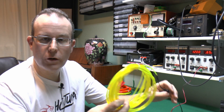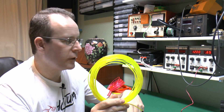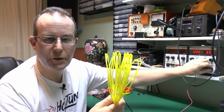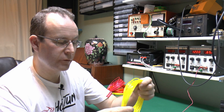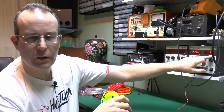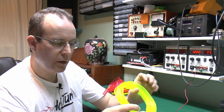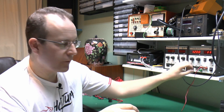So that's a quick look at electro-luminescent wire. In normal lighting it's not that bright or impressive — you can see the difference between on and off — but we're using this outside at night, so that doesn't matter. In terms of current consumption, a 10-metre length with the driver uses only about 113mA at 12V DC — very low. That's also why brightness is relatively modest. Next time we'll look at actually putting together the Christmas display. Thanks for watching.